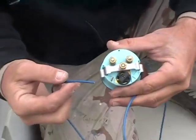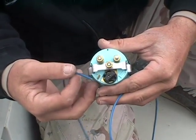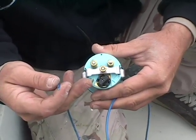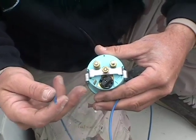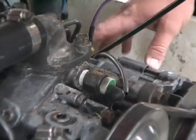Blue in the dashboard wiring sequence is light, so it'll be a spade connector soldered onto the end of the wire with heat shrink, and then daisy chained over to the next light, so all three of them will be in series on the back of the panel itself. And then I'm going to follow this cable to right here to the corner.